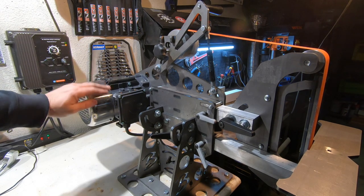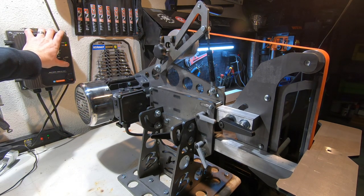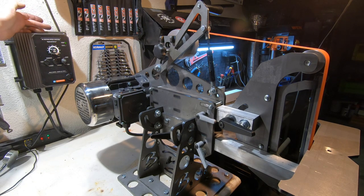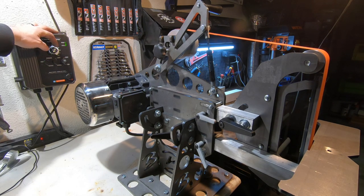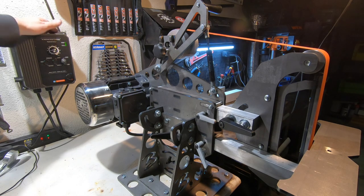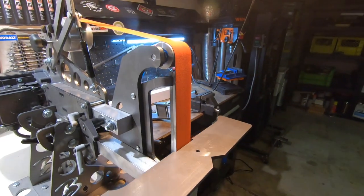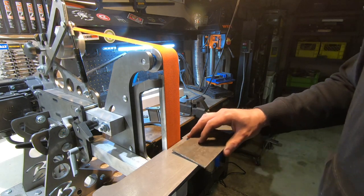I got it shipped with the motor and the VFD. I wall-mounted the VFD — it's out of the way, it's great. It's got a great switch and it's pretty quiet. Mind you, I only have it at 30% here — I'm going to push it up to a hundred. Let's take some metal down with it — I only have a 120-grit belt on it but we'll give it a shot.